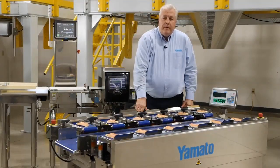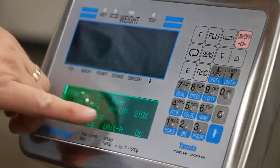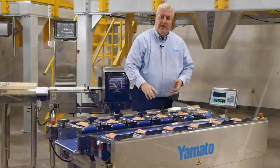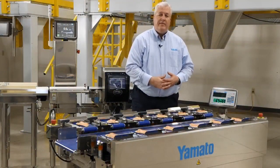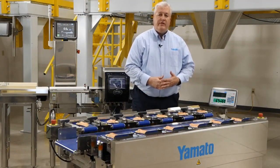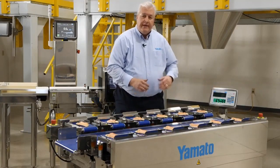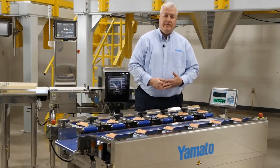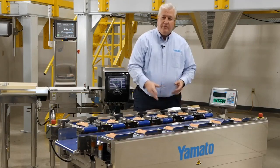So, how does the machine operate? We have load cells under each one of the weighing heads. The product specifications are input into the indicator — we set a low limit, which is your target weight, and a high limit, which is your allowable giveaway. The operators hand load product onto the weighing heads; that's the semi-automatic portion. The product weights are sent to the indicator, where the software determines which combination of side weighing heads will discharge to keep the result as close to the low target limit as possible. Running speeds are capable of up to 40 weighments per minute, and when connecting to peripheral packaging equipment you can expect 15 to 20 weighments per minute due to signaling between the TSUW and the packaging equipment.